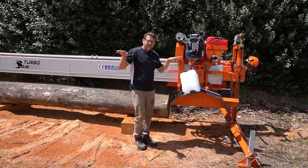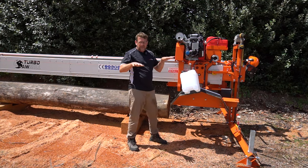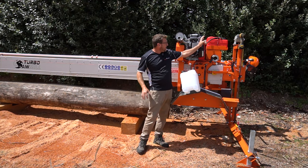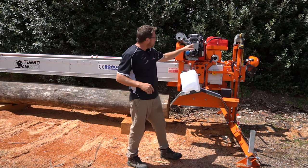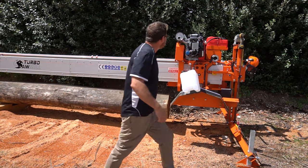Especially when you're running such a narrow kerf, you do need quite a strong lead-in. So we'll leave those settings and we'll just adjust it right there. So we'll do our first live edge slab at the very top, and we'll just compare the two cuts, and then from then on we'll adjust it from that unit.